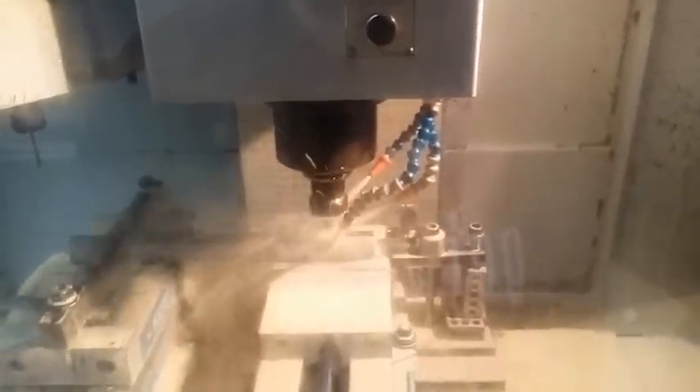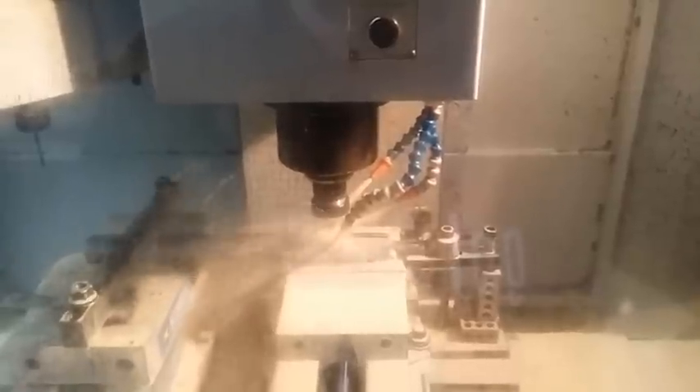In the first part of this video, you're going to see us removing the majority of the metal from the upper receiver. This allows for the bolts to fit into the grooves that we've cut in the lathe, and it also allows for the opening that we have to have to allow the upper receiver to slide over the front barrel support.